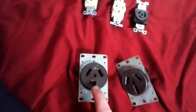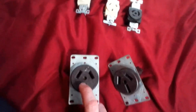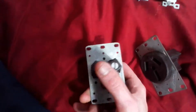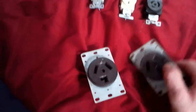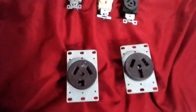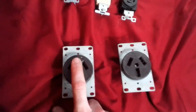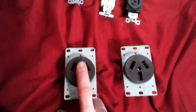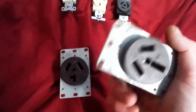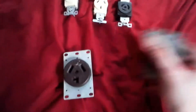You can make these compliant if the ground wire is here and you have your two hots — you still have to have a neutral in the box, but it will work. The problem is that nowadays the dryer cords that come with dryers won't fit in this, so you have to replace these with the newer ones. This is the 50-amp stove plug — same thing.